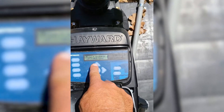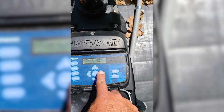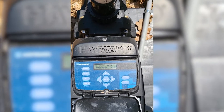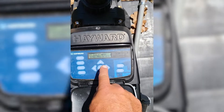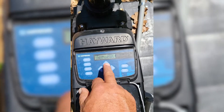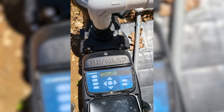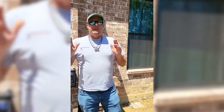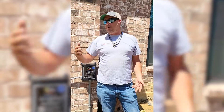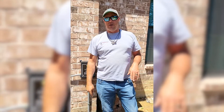So this is simple enough — press plus or minus to change anything or go to the next timer. Hayward offers up to eight different timers that you can pick. Once you get to the end of this menu, it works the same as the last one — it's going to tell you to press menu to exit. If you've made any changes, it's going to ask you to press plus to confirm and save. Then it's going to shut off and reactivate with that new information. It is extremely important that you remember to save — if you don't save, nothing's going to change. You'll know you did it right when the pump shuts off when you're done and then starts back up again.